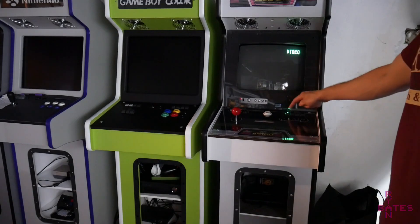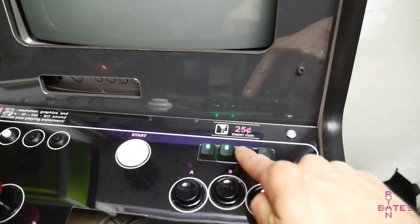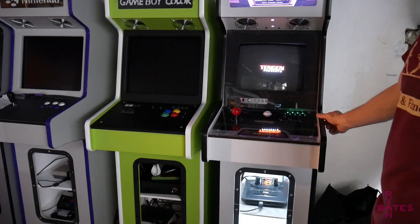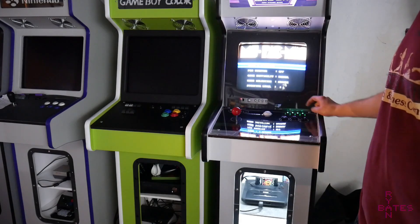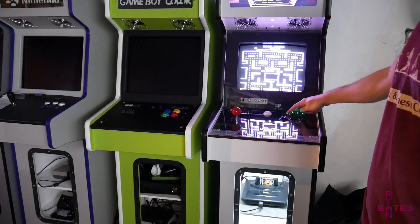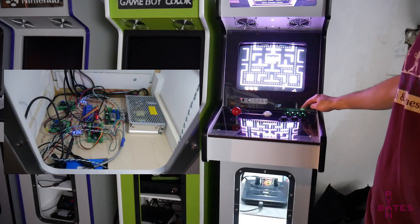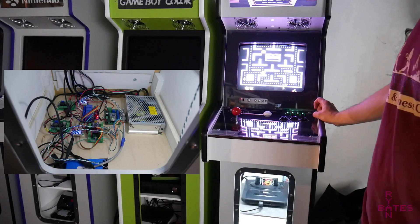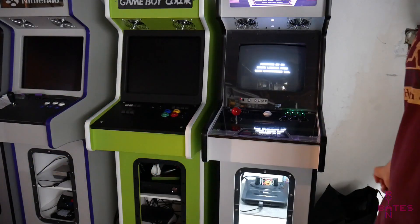I have one more unnecessarily complex control panel. This Sega-themed arcade uses four backlit key switches to toggle on and off the main parts of the arcade — that's the interior lights, the marquee, the game console, and the audio amp. I don't recommend this as the core functions of the arcade are literally wired to the control panel, so that hot swap feature isn't a go, but it's still cool nonetheless.